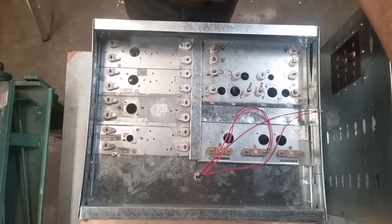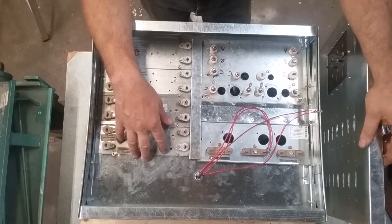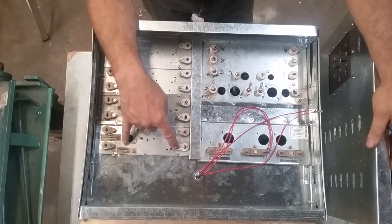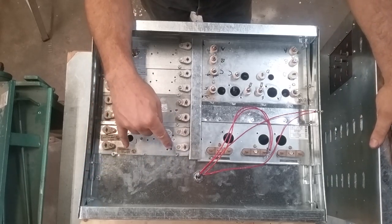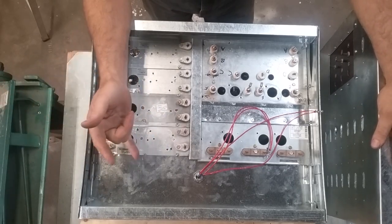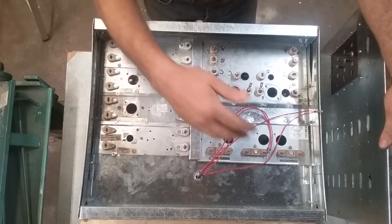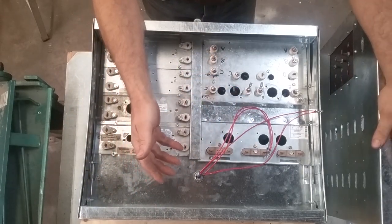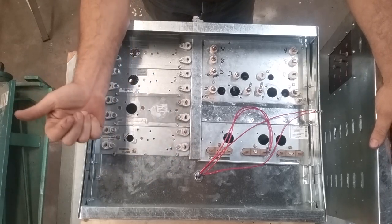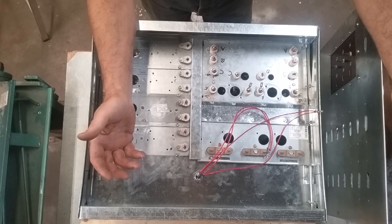I was load banking a Kohler, and they're kind of hard to get anything hooked to. They're hard to hook the damn wires to start with. So I didn't want to screw with trying to hook up on the generator, so I usually hook up at the transfer switch. But anyway, I was inside the house. There was a leaf or some crud that had fell into the coils. I flipped her on. Of course, the coils are glowing red.